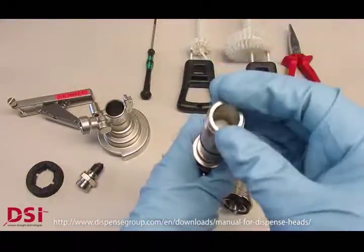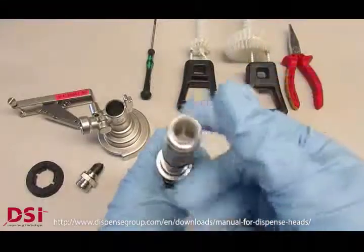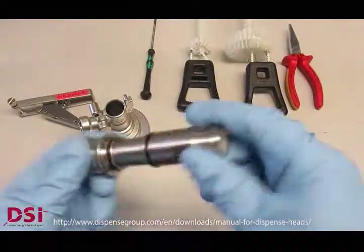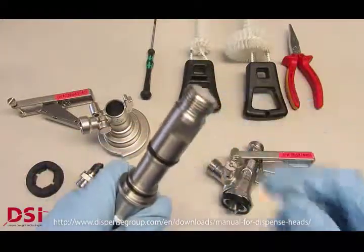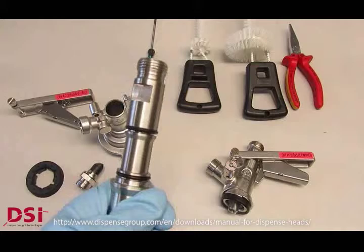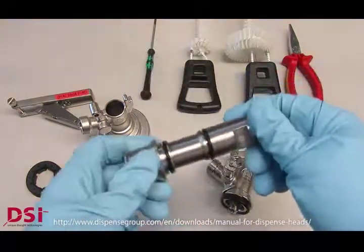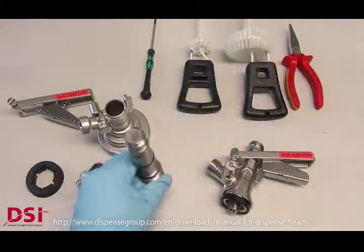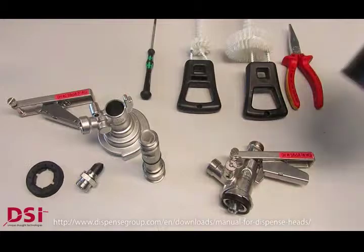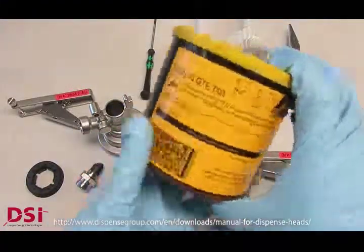Place the ball into the seat and push the captive or ball retainer into the seat at the top of the piston. Do not forget to grease the O-rings after reassembling in order to make sure that the coupler is working fine all the time long.